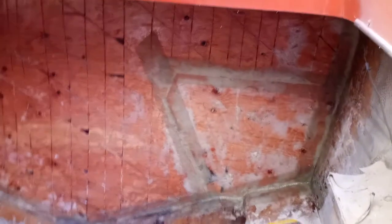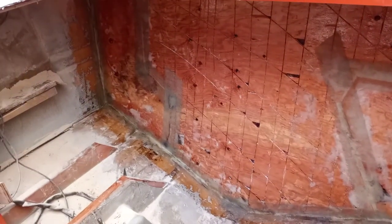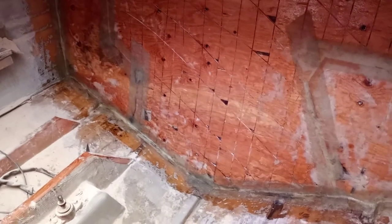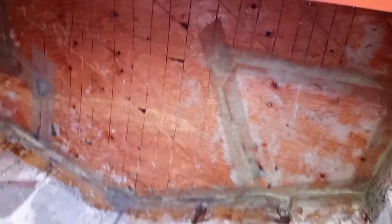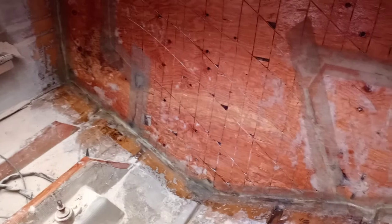Looking forward to that. So there you go. That's after those air pockets, we cut that all out, chiseled it all out, ground it all down, filled it in with peanut butter, redid the transom in those spots. Much the same as you would if you were going to do a rotten transom and keep some good wood, if you had any good wood. Usually it's around your bell housing. But no, that's how you do it, boys. And so as of now, we're back to a mint transom again that I feel good about.